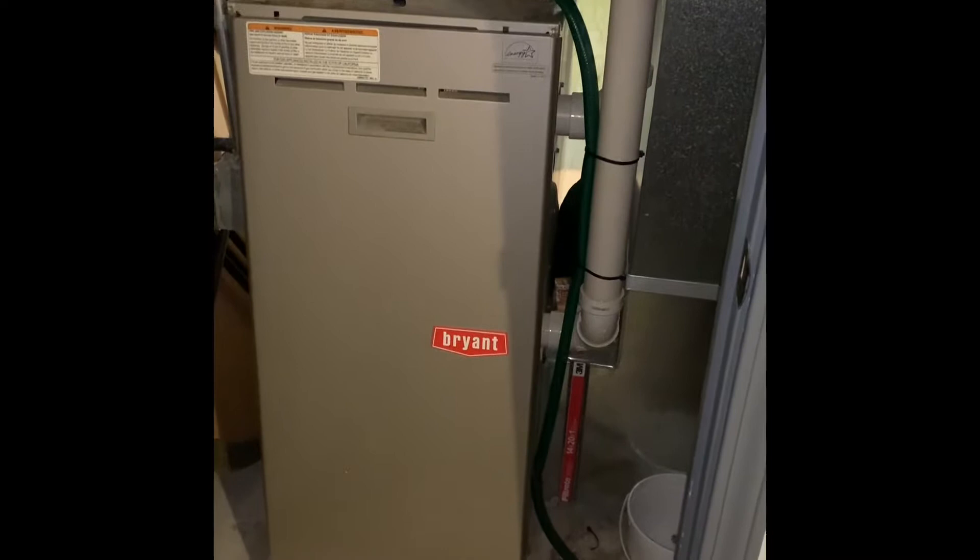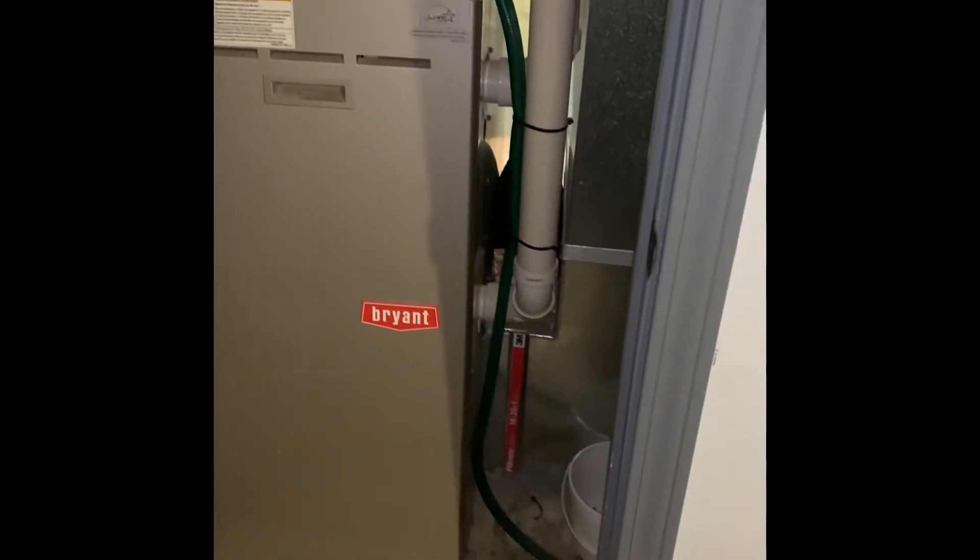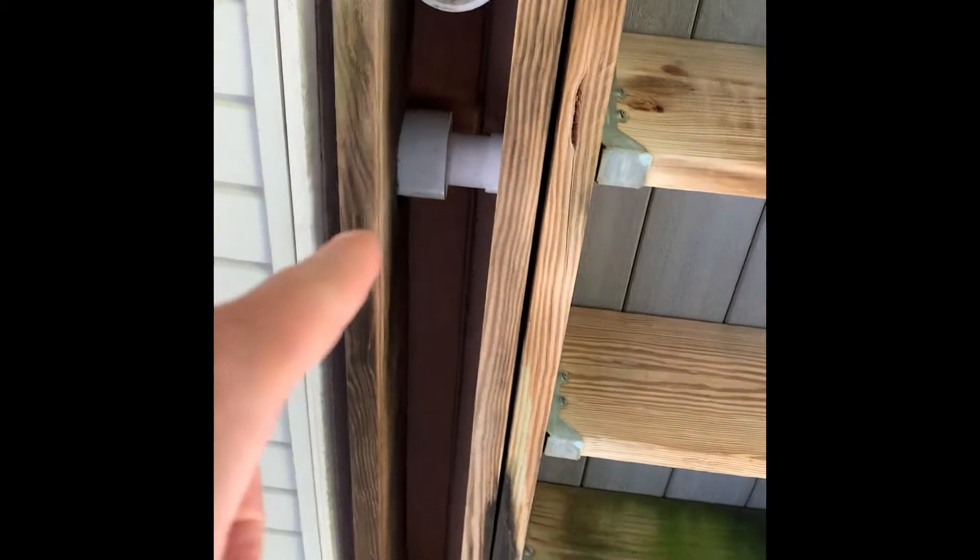New Honeywell Vision Pro with Wi-Fi. Here's our PVC pipe where it terminates. That right there is your water heater — that was an old concentric. What I need to do is get the intake to this side, so we'll take two-inch PVC and the three-inch and get it to this side of the deck. If the inspector says anything, we'll have to take this down, get rid of the concentric, and take two two-inch PVC pipes all the way to the end if possible, or at least get the required distance away from the water heater.